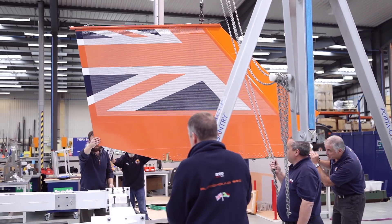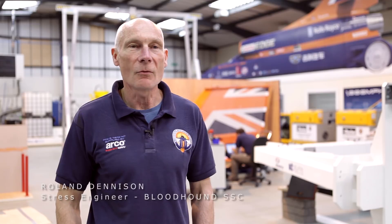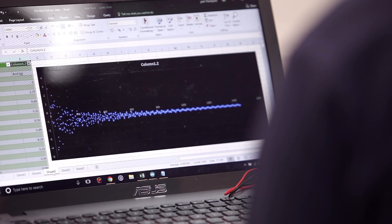Today we carried out a load deflection test and a dynamic test, which is normally called a bump test. You hit the fin with a hammer or something and you can measure the frequencies with an accelerometer. And depending where you hit it, you can excite different modes.